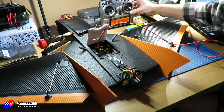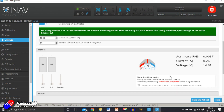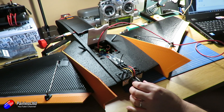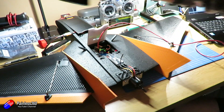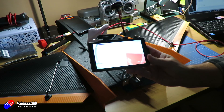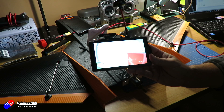Now we can test the motor. We haven't got the prop installed, so we're going to enable live outputs — this means we can run the motor directly from the computer. We're going to raise the master just a smidgen, and that is moving. That all looks fantastic, so we're in really good shape. If we put on an FPV screen — can we see the camera? Yes we can. And we can also see the on-screen display; obviously it's looking at the wall at the moment, but that is really promising.